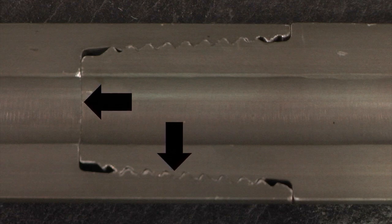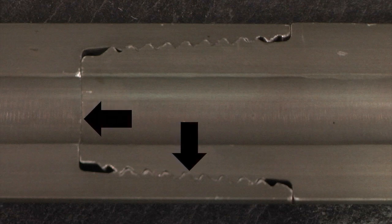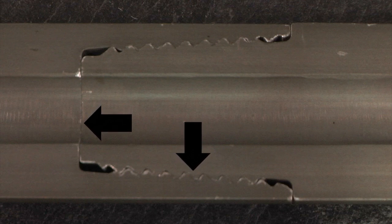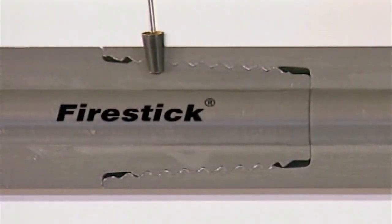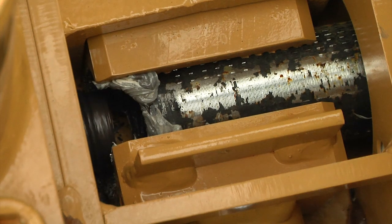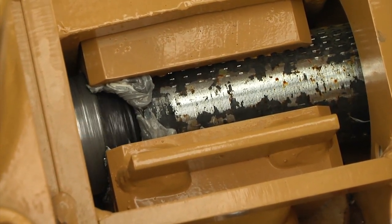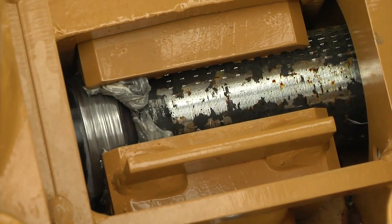There is a barely perceptible thousandth-of-an-inch gap. When optimal makeup is achieved, this gap closes with this double-shoulder design. Both the inner and outer shoulder handle the down-hole stress, lessening the threat of swelled box ends which result in pin fatigue. That's why clean threads and complete use of full makeup torque are critical components of directional drilling success.